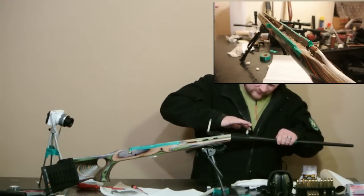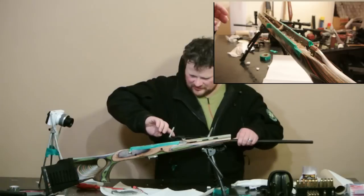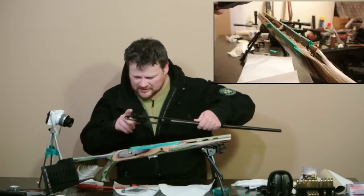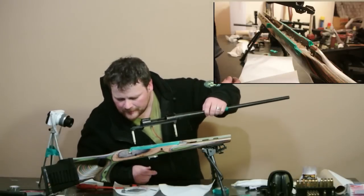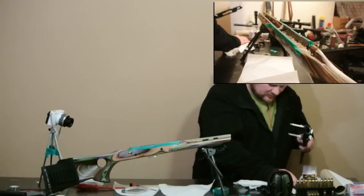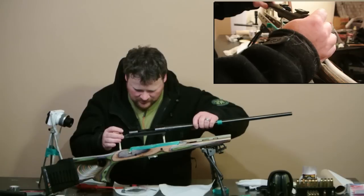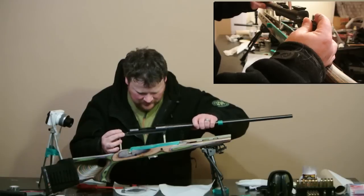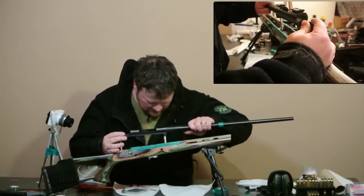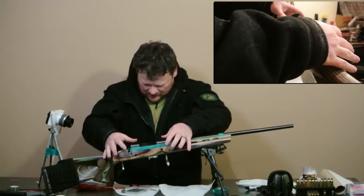Our action is completely waxed up, and our two locating rods are in the takedown screw holes. When you push this in, it's going to push out the tissue on the bottom. We'll get a little bit of drippage but we should be fine — there's lots of release agent on this. Here we go. I'm going to put it in, push it down, find the hole. There we go — that's down. That's sitting in and it's pushing out the two sides.